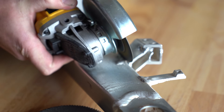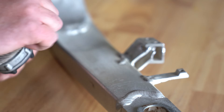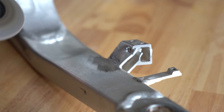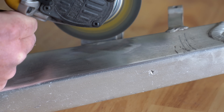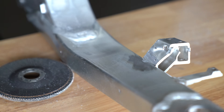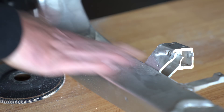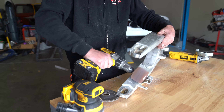With that side on and cooled down, I went back to the third shop. I forgot to lock my focus in, but I'm using a cutoff wheel to cut the old weld out down into the groove. Then I used the flap disc, just the same as before, to knock down the remainder of that weld. I used the cutoff wheel to get down into that groove and kick off some of that anodizing and flatten some of it back out. Once again, just like before, we hit it with the DA — make sure it gets nice and blended, get rid of some of those marks. The edge of the sandpaper gets down in there nicely. Then, once again, with the flap drum — just a nice, smooth grain — get rid of most of that anodizing and we're pretty much set.